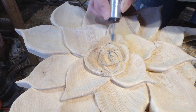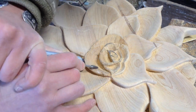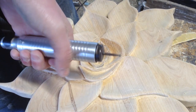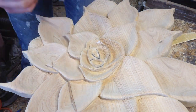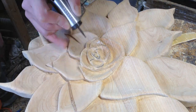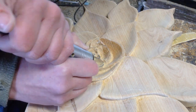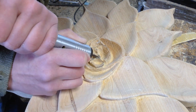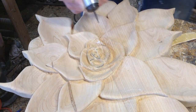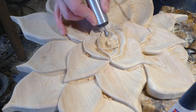To do the interior I didn't have a chisel set small enough, so I did a lot of this power carving with a Dremel. I would have preferred to use chisels - especially with the tips of these leaves, I broke some of them off during the process. You can see some of the glue lines where I put them back together. The Dremel is a little aggressive and it did chip some of this off, but I'm just using some of my smaller bits to create depth and undercutting in those sections. This rounded bit is not really ideal but it's really the smallest one I had to get into these parts.